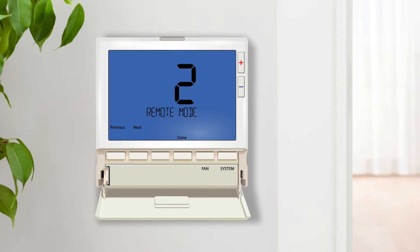Using an outdoor temperature sensor improves the efficiency and system performance by combining the local temperature and thermostat staging logic to determine the most appropriate heat source or combination of heat sources each time there is a call. These settings vary depending on whether the system uses dual fuel or electric auxiliary. The heat pump and auxiliary should never run together in a dual fuel system.